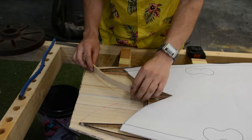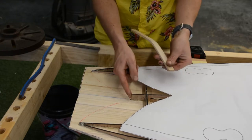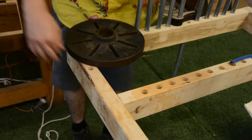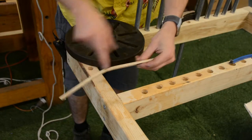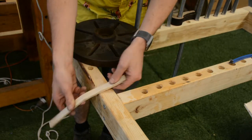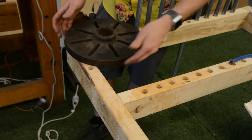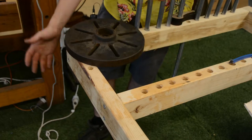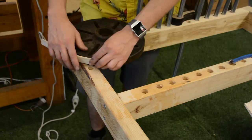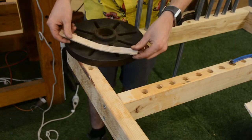To fill in this fish tail we're going to use some steam bending of offcuts from the deck that we've ripped down to be the same height as our centre spine — so 20 millimetres. To bend the wood you could just use the edge of the bench, as we did on this first test piece, but you can see it does create a little bit of a sharper bend in those areas on the edge of the bench. If you can find something round — I've got a face plate off an old lathe, but a paint can or something of at least a fairly decent diameter works — you can use that to gently bring your bend in and keep things symmetrical.